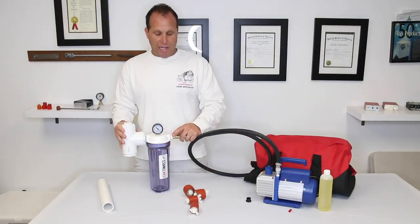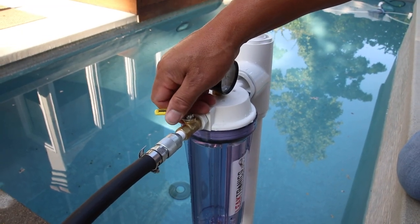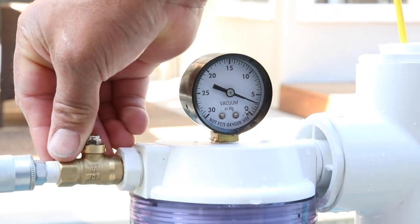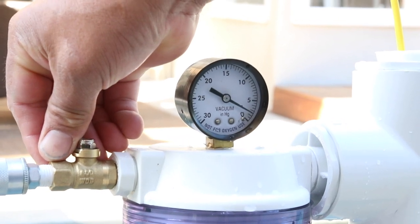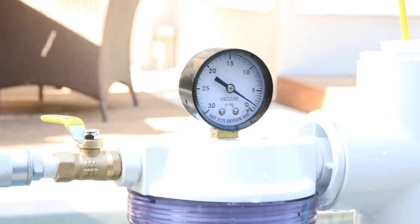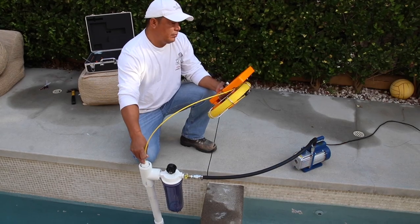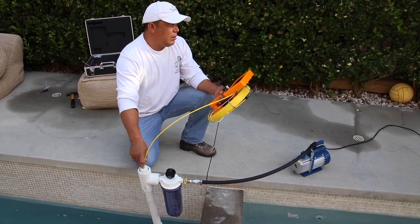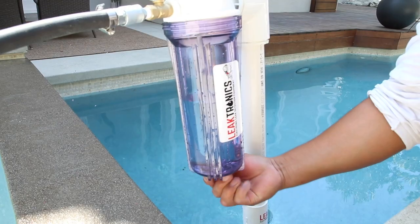Fire up your vac pump and control your vacuum with this valve right here. Any sign of vacuum — even one — means that pipe is now sucking. If it's at zero, it's not. Dial it in until you get between one and three on the vacuum side. That means the pipe is now a suction pipe, and you can start pulling the camera out slowly until you get over what you need to see.